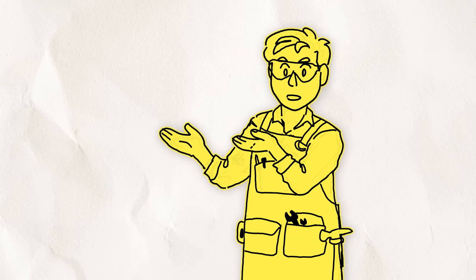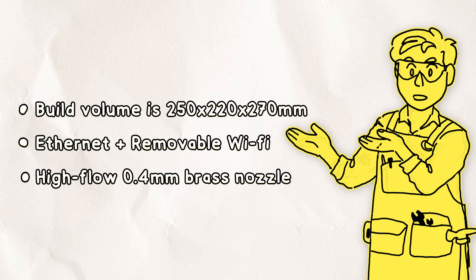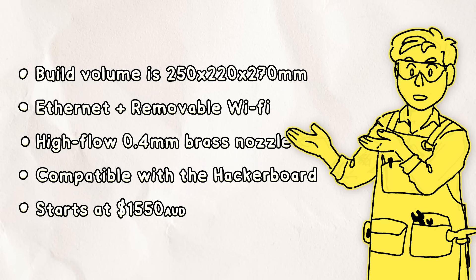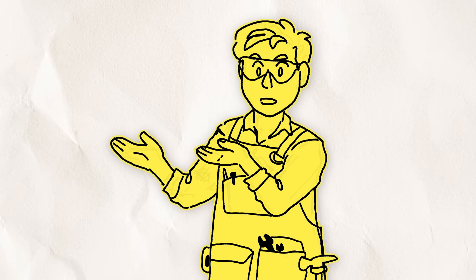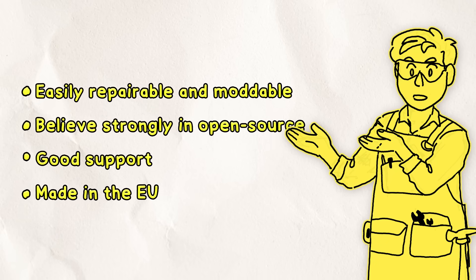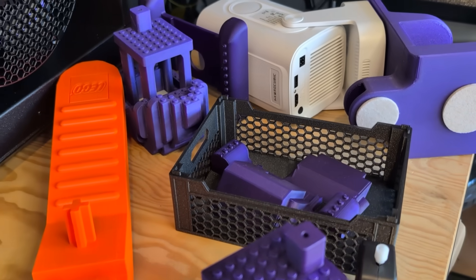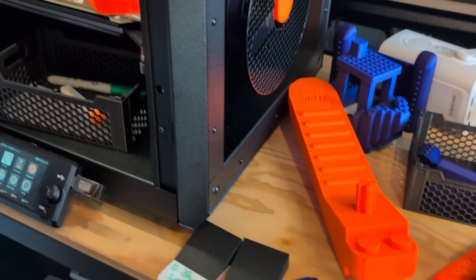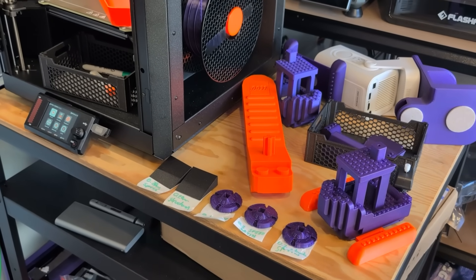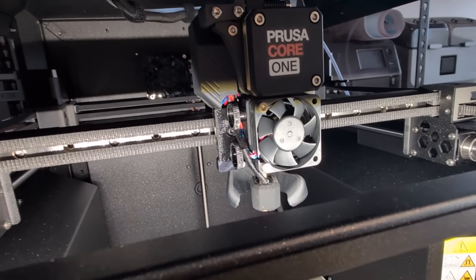Before my final thoughts, here are some quick specs: the build volume is 250×220×270mm, there's an ethernet port, the Wi-Fi module can be completely removed if needed, it includes a high-flow brass 0.4mm nozzle, it's compatible with the hacker board for hardcore modders, and it starts at $1,550 Australian dollars. It's true that it's not cheap, but people don't buy Prusa because they're inexpensive. People buy Prusa because they're easily repairable, believe strongly in open source, have good support, are made in the EU, and are just plain polished — you simply can't say most of those things about a lot of other 3D printer brands out there today. From my initial printing experience, and despite some of my earlier complaints, I'm very pleased with the Core 1. It is an extremely solid, function-over-form 3D printer, and you'll definitely be seeing this machine around a lot more on my channel. I did plan to do an X1C comparison here at the end, but my X1C seems to have a few problems I can't permanently resolve right now, so let me know what else you'd like to see in the future or if you have any questions. Cheers.